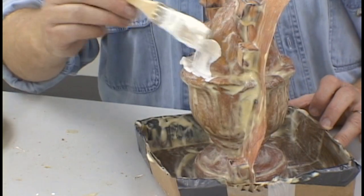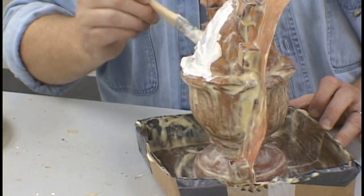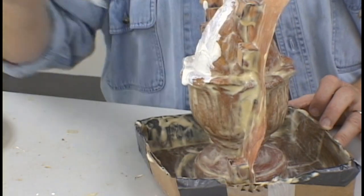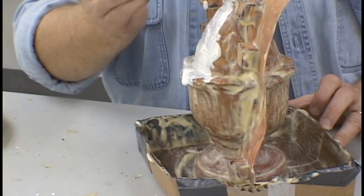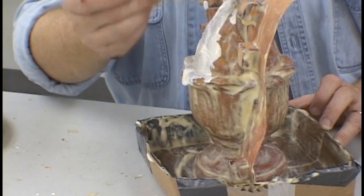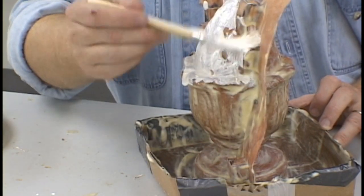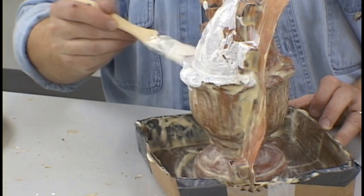As our coats of latex begin to build up on the model, you will see a change in color from totally clear to an off yellow. As the coats build up, it will eventually turn completely yellow and opaque, and you will have a nice thick coating all the way around the entire surface of the model and the parting plane.